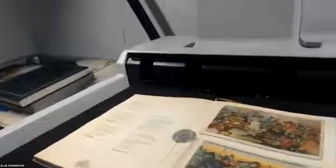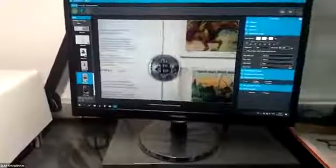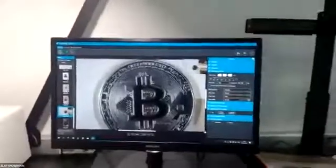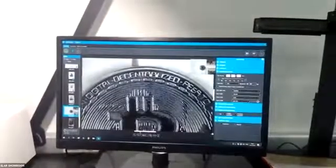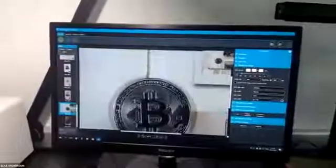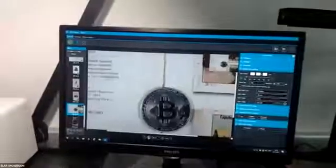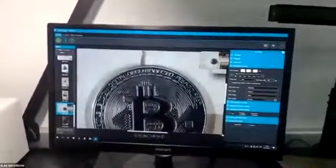Yeah, and really, we are scanning much better than in our technical characteristics, and this is a problem of our sensor. The formal resolution is really lower than the quality of the image. So this is a 400 model with a 24 megapixel camera. We can achieve 900 or 1000 dpi with that and use this light microscope. You can imagine how the scanner works with a 100 megapixel camera in the configuration of C2-800.